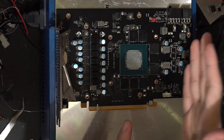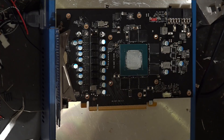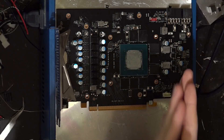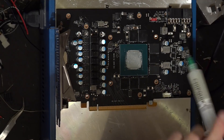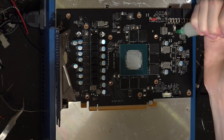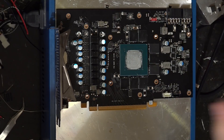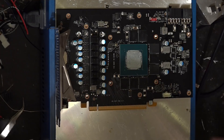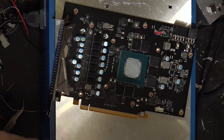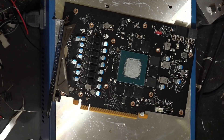You can do this with just two soldering irons — that's the bare minimum requirement for a shunt mod. Not one, because with one soldering iron you'd have to heat both tabs at the same time and it's going to be super fiddly. I've decided I want to clean up the solder because it just doesn't look very nice, so I'm going to put a little bit of flux on it and go with both soldering irons at the same time to clean that up.